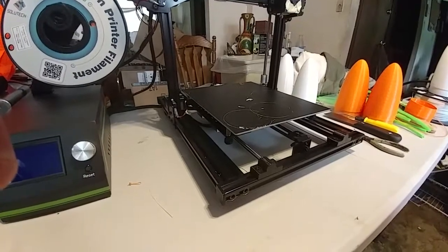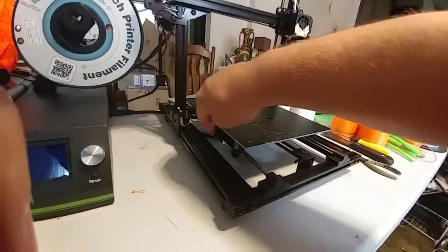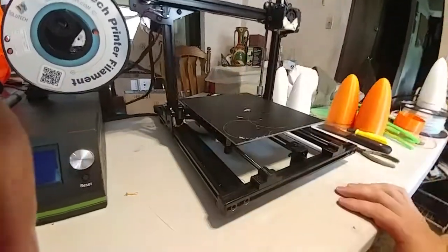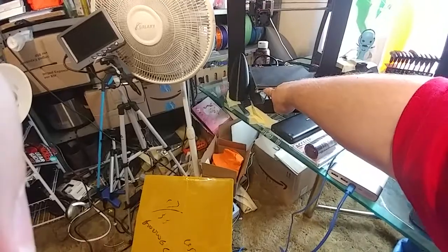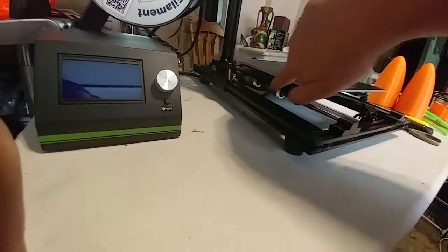If you rotate these motors you can probably get away with keeping the H-brace, but if you can change it without increasing the cost, do it — just make sure it's thick. Do not go thinner than this because that's how you get warped beds. That's the primary upgrade on the Wanhao — replacing that thin plate with a thicker one. Yours does not appear to have that warping issue; it's a nice thick plate.